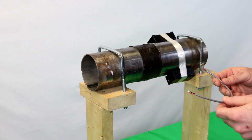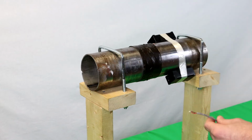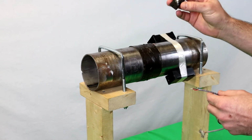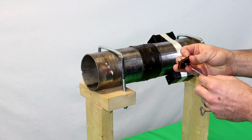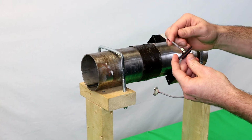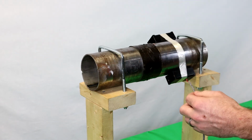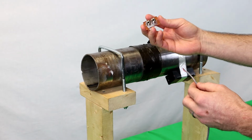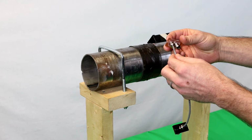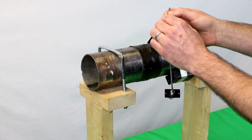After you cut, strip, and tin your cables, the first thing you want to do is take your power cable and using the battery cover, route the cover through the cable with the wire gland facing toward the tinned wires. And your transmitter cover, you can route this through either one of these glands. You'll want to make sure that the gland is facing the battery gland.